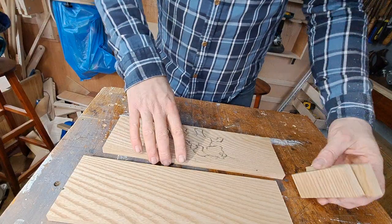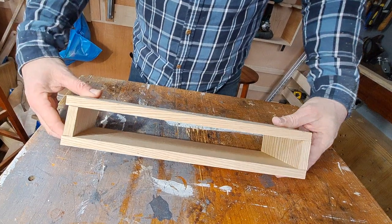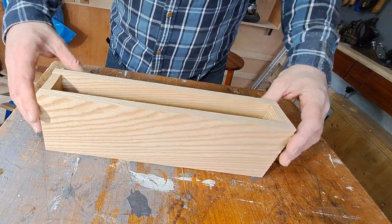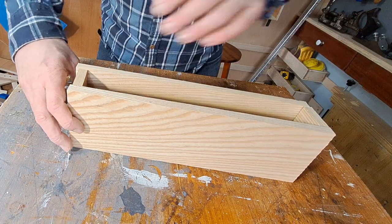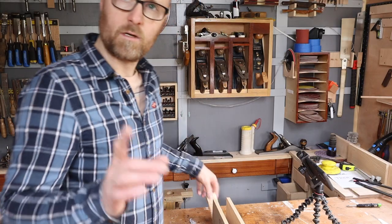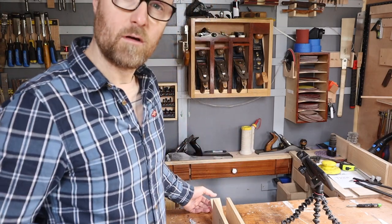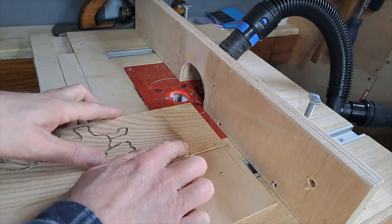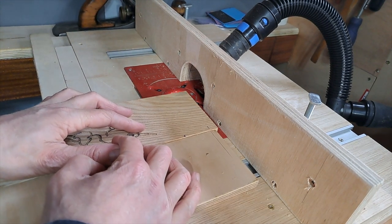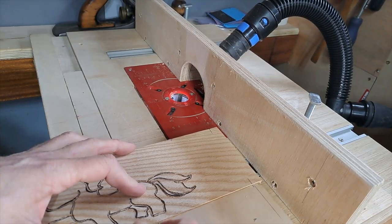Now we've cut all the box parts, they're going to be fitted together to make a very long box to hold pens. I want to put a rebate on the insides to make it a bit sturdier, and it needs a section in the middle otherwise pens are just going to fall flat inside it. I'm going to cut one more piece and then use the new router table to put the rebates on. It did go wrong — the mitre gauge wasn't strong enough to stop the router pulling the wood, leaving a completely non-square rebate which will ruin your box. Things definitely went awry later for the smaller ones.